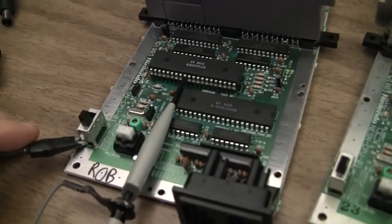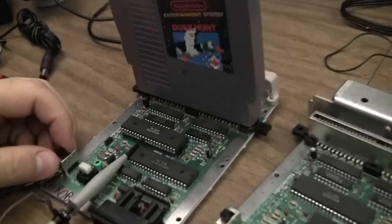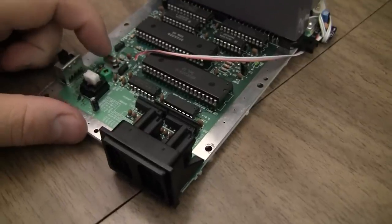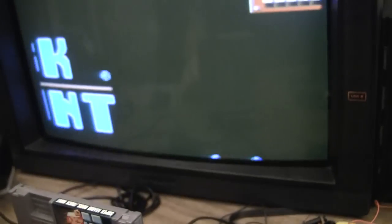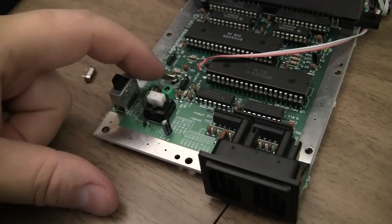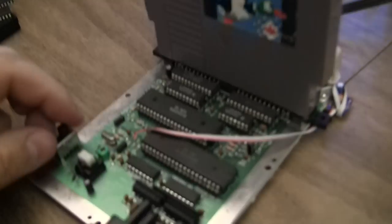What I still do not have is a clock signal — power on, power off, it glitches a little bit, but I don't actually get the signal. So maybe the actual crystal itself is bad. Just for a sanity check, I put the working CPU back in the test board and socketed the crystal to retest it — and it works. So we know the CPU is still good and this is a working crystal setup. Now I've swapped in the suspect crystal from the bad board — but no, the crystal is good. So it's something else.